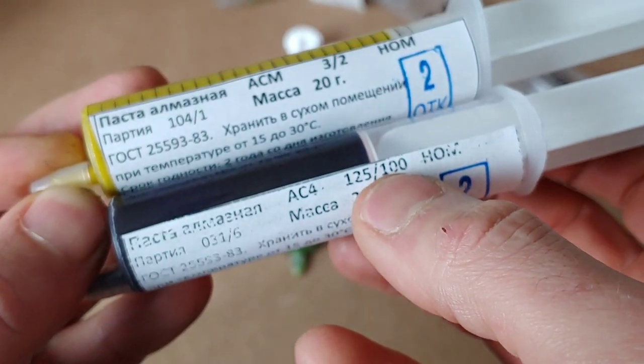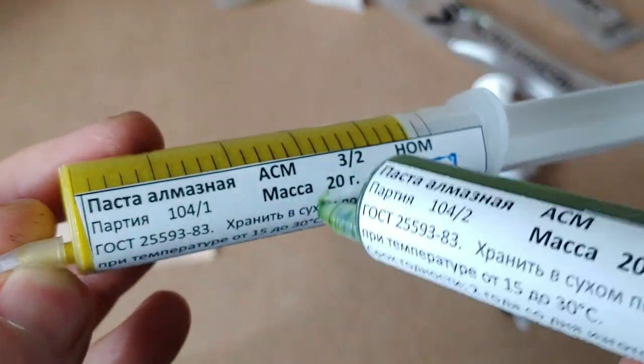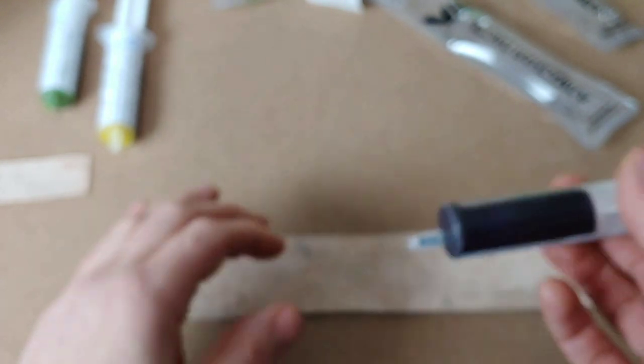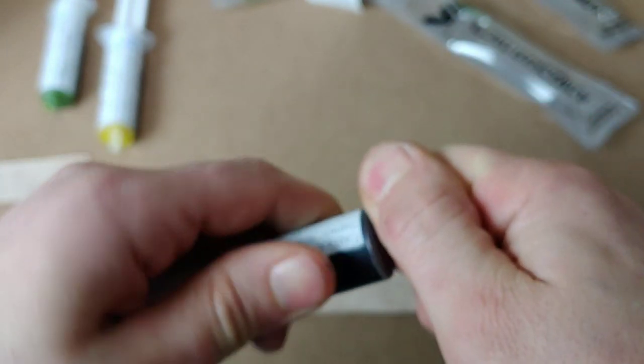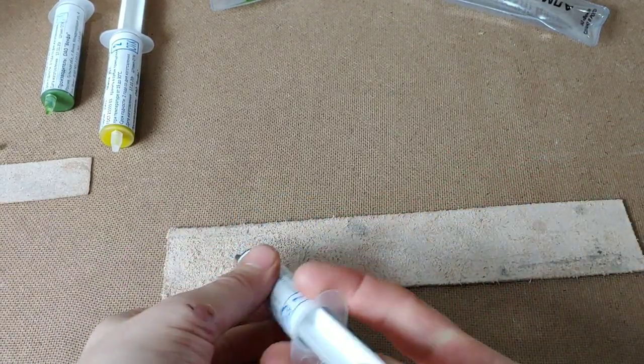Let's get back to sharpening. I'm guessing this is the coarsest one, this is the middle one, and then this is the finest — the yellow. So when you're putting this stuff on — I've never had this stuff, so I don't know a lot about it. But I've had aluminum oxide paste before and I know you only want to use a little tiny bit and rub it on. Now this is diamond compound, so it is a little different. You do have to let it dry — it's going to take probably about a day to really dry.